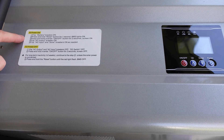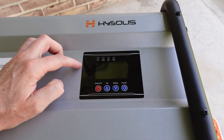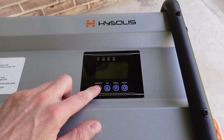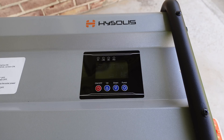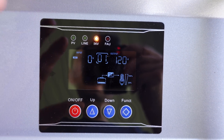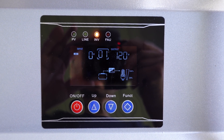On the top of the device, we have some power on/off instructions on the left. On the right hand side is the control panel. You'll want to flip the battery breaker on first. To turn this on, press and hold the power button for about two seconds. You'll hear it beep quite a bit and the display will light up — the display is on but very dim because we're outside and it's bright today. The display is very similar to many inverters on the market, so I suspect similar electronics inside.